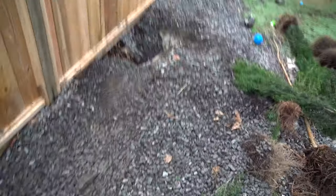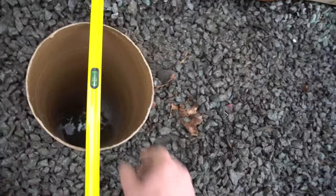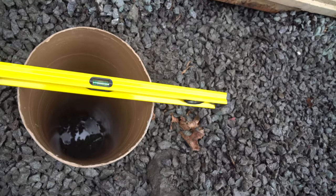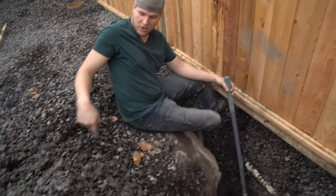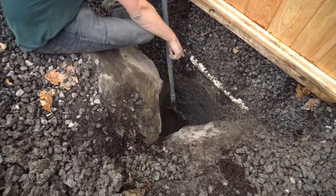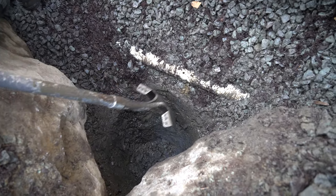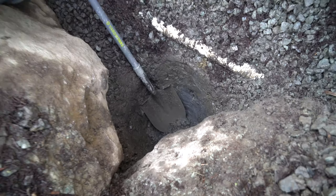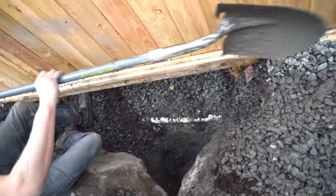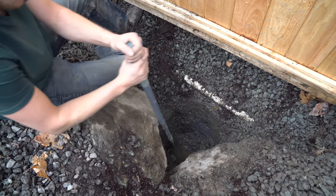That other side's going to be harder because of how the grade is — I can't build the ledge the same way and I have to dig down to four feet. After the last final measurement and level check, we're set. And there's all this clay — you've got your easy brown clay up top, and then look at that grey clay underneath. It's tough to dig through, but it is the best foundation you could ask for. This is really, really good — as soon as I saw it I thought, okay, life just got worse for digging but a whole lot more solid afterward.